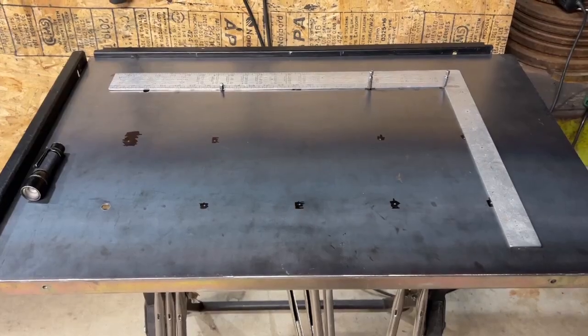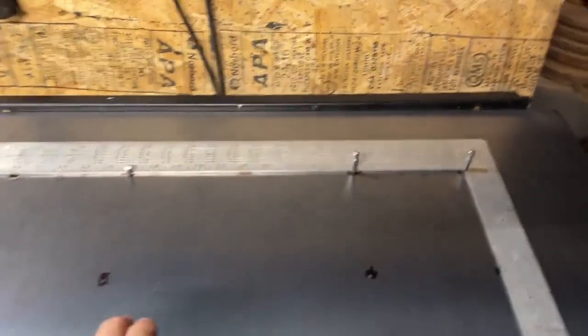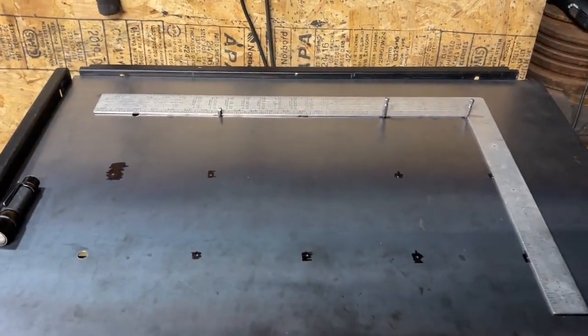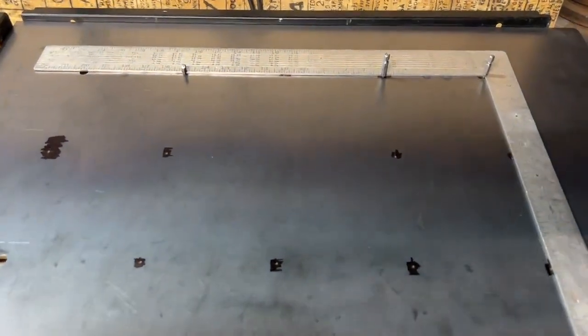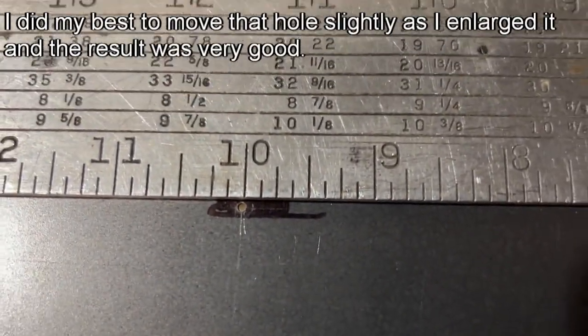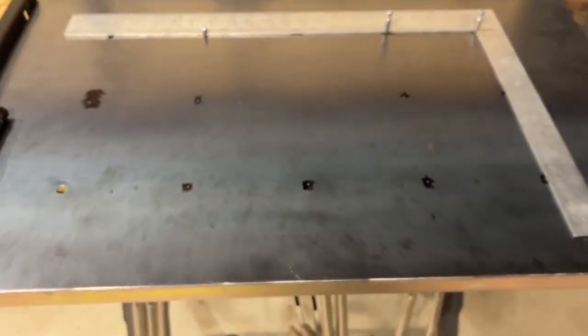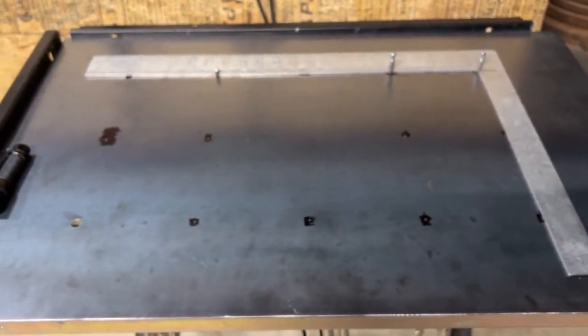I marked my holes and drilled 1/16-inch pilot holes, and I'm really happy with the result. I've put three 1/16-inch drills in the holes as alignment pins — these are broken drills I've kept around for exactly this kind of use. The worst alignment is one hole that's not quite up against the rafter square, but the rest are really quite good and square. There's no hole in the center because the slot in the welding table doesn't go through the center, so there's no place to put one there. Pretty good for doing it by hand.